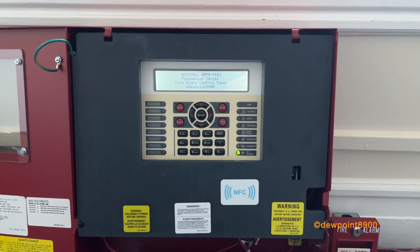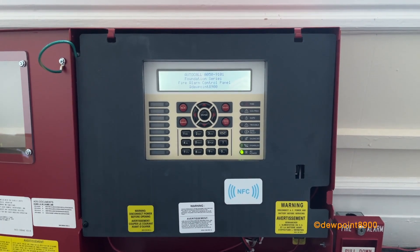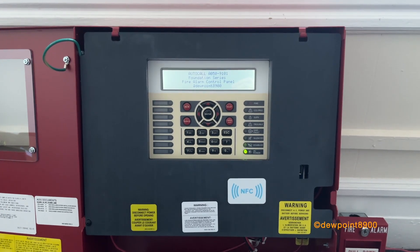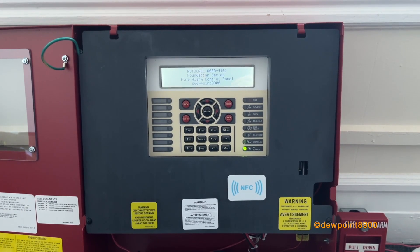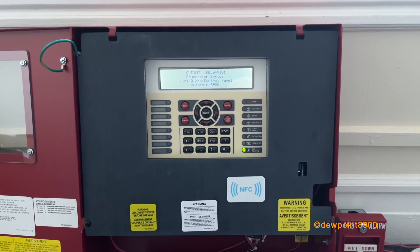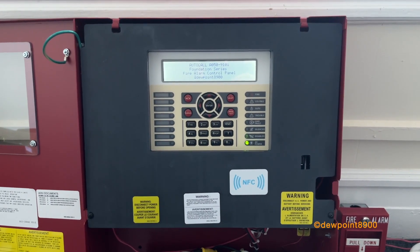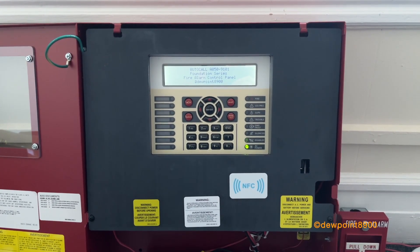So that's pretty much it for the AutoCall 2050FS. Overall, I do think this is a pretty good addressable panel. As with all the Foundation series, it's designed to be less expensive, less proprietary, and easier to wire and program. With the many ways this panel can be programmed, I'm sure this will be easier to maintain in the field, but we'll see. For enthusiasts interested in a small Simplex addressable panel, this may be a decent option, though there are some considerations. While it's very easy to program — as the software for the AutoCall ones is relatively easy to obtain — this panel uses a new MX protocol which is not backwards compatible with IDnet. And this panel is still relatively new and seems to have some bugs and issues, which will hopefully be patched out in future firmware updates.